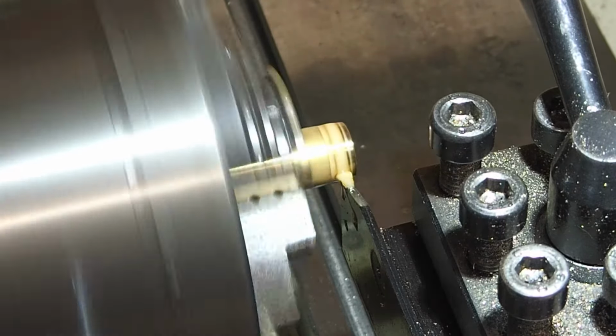And that's the 5mm hole all the way through the part, ready to be tapped with the M6 tap. The tapping's done in the lathe. The tap's kept straight with the spring-loaded tap follower held in the tailstock. Now I won't bore you with the tedium of tapping a deep hole. I'll jump forward to the end.